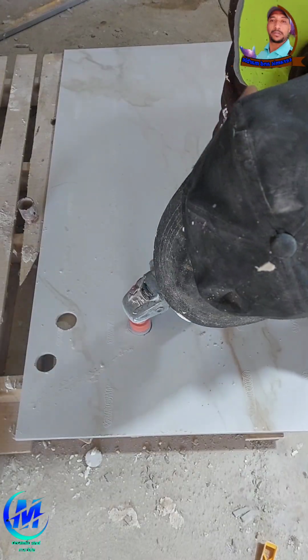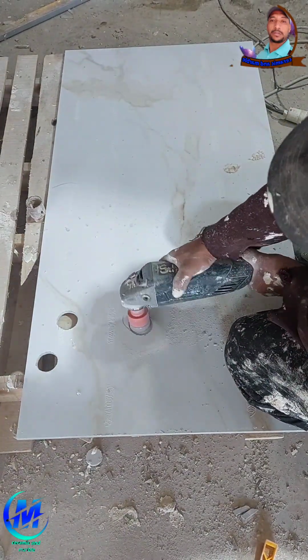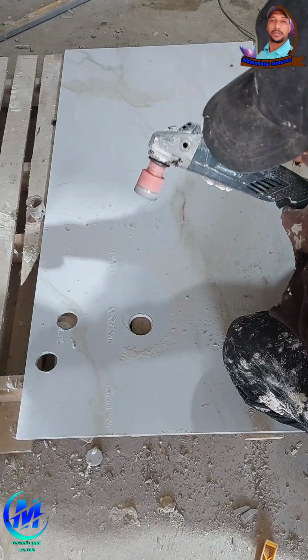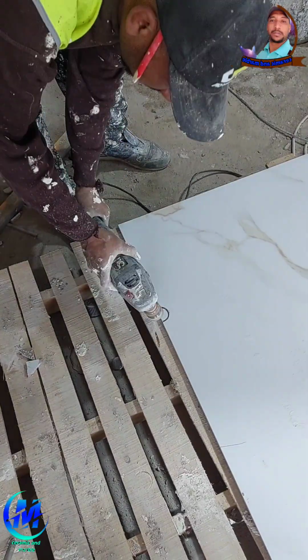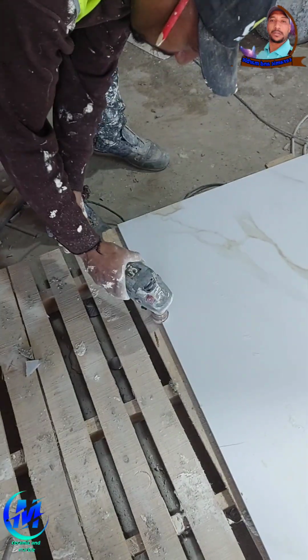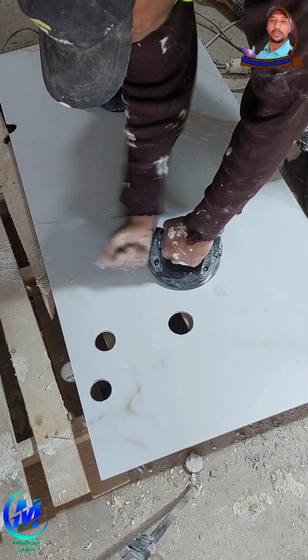7. Review before committing. Measure twice, lay once, before you continue with more tiles. Step back and check alignment. Make sure the tile sits exactly where you planned. Ensure it's level and square with the layout lines. If you notice any mistake, this is your last chance to fix it before the adhesive sets.